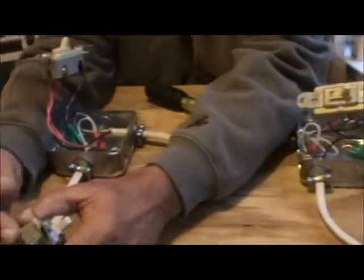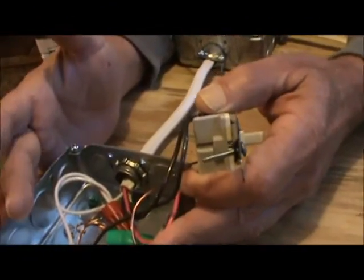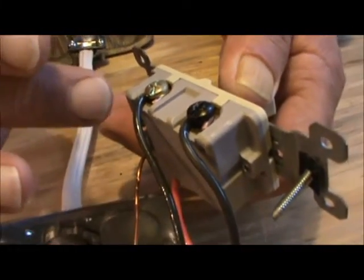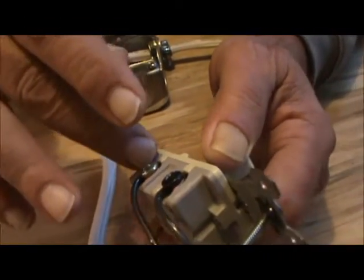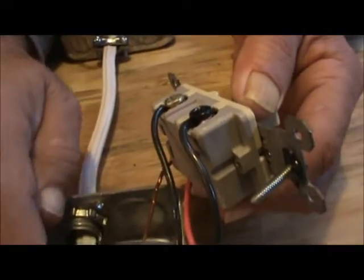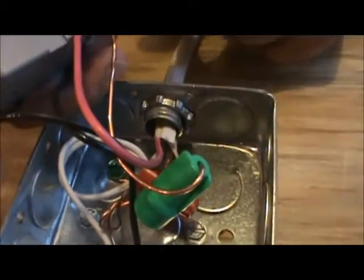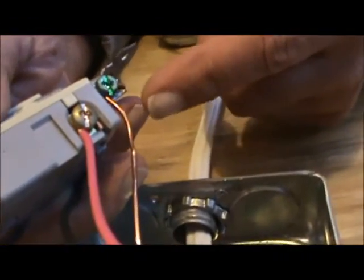Your hot wire comes in from your Romex feeding your switch circuit. The black wire goes on the common screw — it's always got to be a darker color. Then you put your red and your black on a three-conductor going to your next switch, on the other two screws called the travelers. Your white wire just wires them together. Your bond wires are the non-insulated. Some switches have a green wire instead of a screw, but these have screws. So you have your travelers on these two screws and your hot wire on the dark screw.